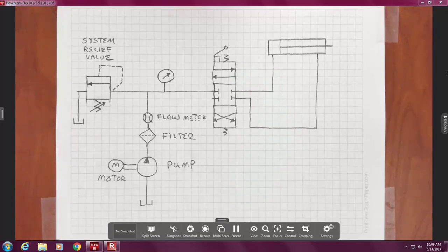Why would you put a one-inch, I'm just calling this one-inch, if I'm wrong, just ignore it, but why would they put a one-inch here and then go down to a half? Why would you take a one-inch wide chain and go down to a 25 bike chain? Why would you have a big belt and try to get it to run a little belt? It doesn't usually make sense. Normally you don't put 4x4 wood underneath a little bird house for a sparrow. Those are the things that I look at when I'm troubleshooting.